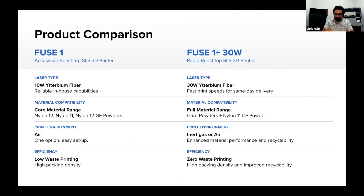We have two SLS 3D printers: the Fuse 1 and the Fuse 1+ 30W. We released the Fuse 1 back in January 2021 and the Fuse 1+ 30W back in July 2022. For the Fuse 1+, a few changes to highlight: first, we upgraded the laser to a 30-watt laser, which almost doubles our print speed, so you can get your parts out a lot faster. We've upgraded our powder handling system and our hopper, which has enabled us to add new materials to the workflow, particularly carbon fiber nylon. Finally, we've added the ability to purge the oxygen inside the printer with inert gas, which allows for better material properties and better material recyclability and reusability.